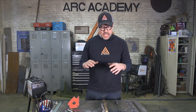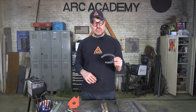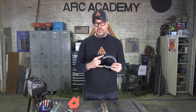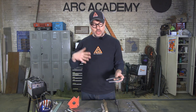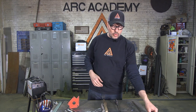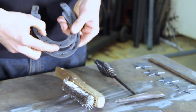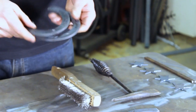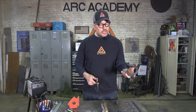Our wine rack is going to be a wall-hanging wine rack, so most of what we're going to do is flat position welding to weld the base together. Since this is quarter-inch thick material, we want to prep our material by chamfering all the connection points for good fusion and penetration. Two of these horseshoes have pre-drilled holes for the wall screws, and the other two are going to connect in the middle — that's how we'll make our base.